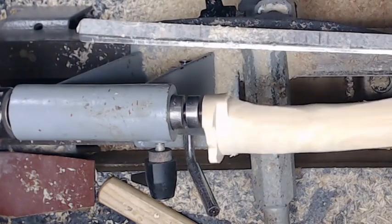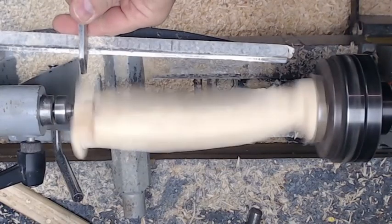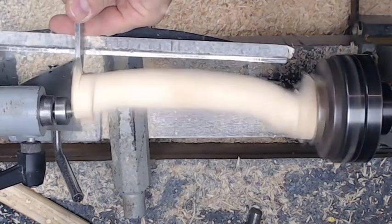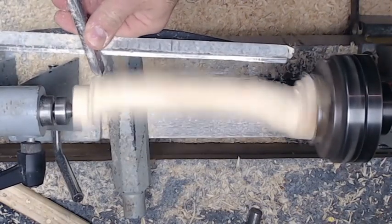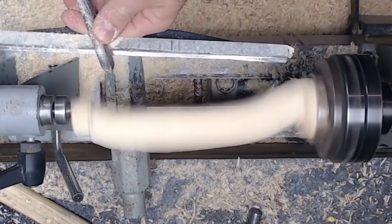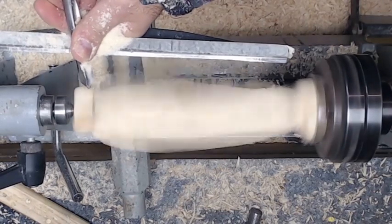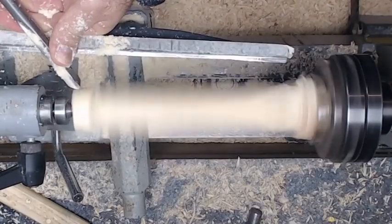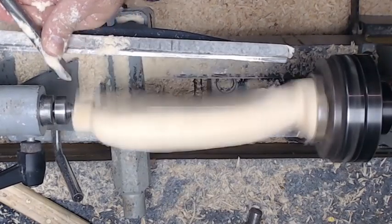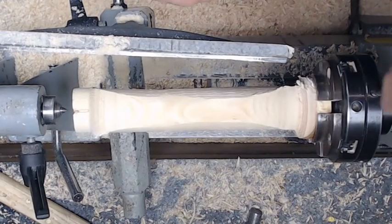And again, we're just moving it to suit the cuts. This is where it's kind of down to you when you start turning it, how whatever shape your banana is, to how you work the stalk. But take small pieces off, stop it, take pieces off, stop it, and there's no rush, and you'll eventually get the shape, and you'll start learning how to orientate the piece of wood to get the best shape you can get. This is just bringing down the stalk, trying to keep it uniform with the rest of the banana so that it's not kind of odd looking.